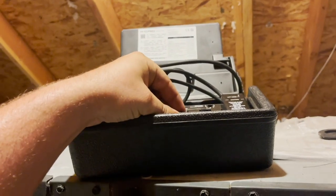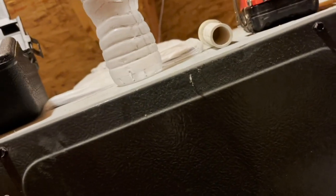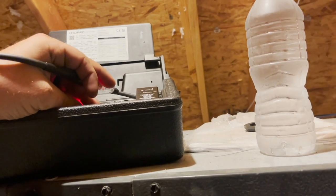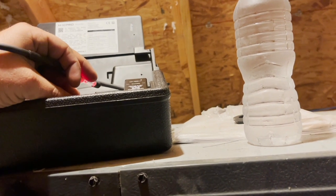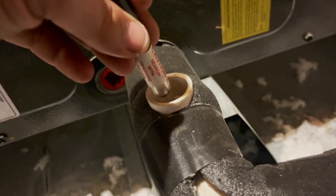We are at the air handler with the H10 warming up - an ARUF 37. I think I can see oil in the drain, and my leak detector was going crazy already a minute ago. Sometimes I don't even have to open up the unit with the H10 - sometimes there'll be enough oil in the drain.